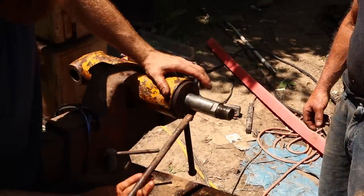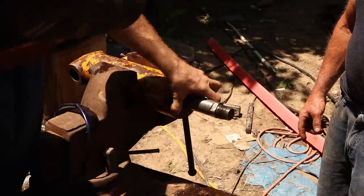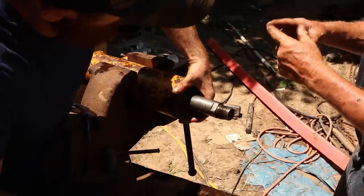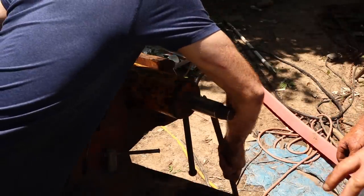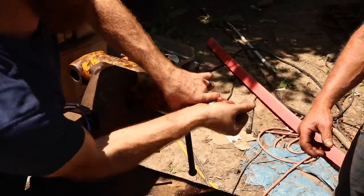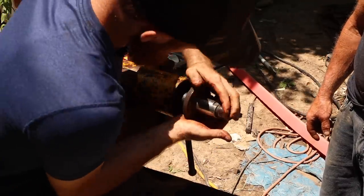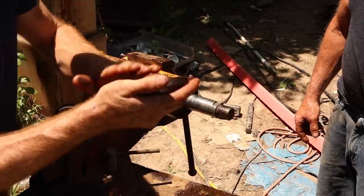But normally what I do with them there is I'll weld the bar across, and weld 3 points. I stick two in, weld it like this and weld it like that, stick it in the vise. Turn the cylinder on there. I put the cylinder on a pedestal with an angle iron, and then just turn the cylinder with a rod down there. That makes sense. And make it locked in. We're doing it the old generic way.